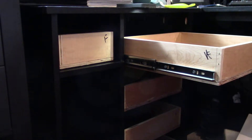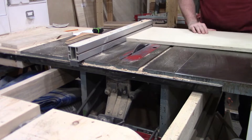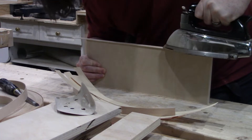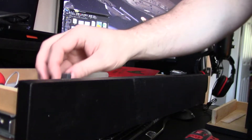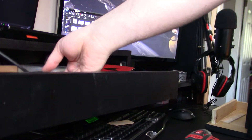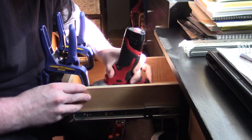And with that all of the drawers are now installed — they just need fronts. I head into the shop and get all of the drawer fronts cut up on the table saw and edge banding done around the perimeter — all the way around, that is what perimeter means. Then I take them all into the basement finishing room and get them all stained and polyurethaned. I purposefully left the whole top of the drawer front short to allow the entire top to operate as the handle, so as long as the drawer front is flush with the bottom of the drawer itself, I'm happy. I clamp the drawer front into place and screw in through the back.